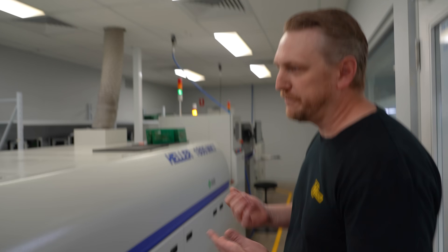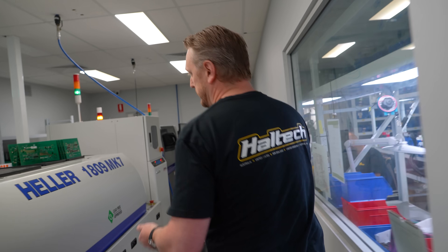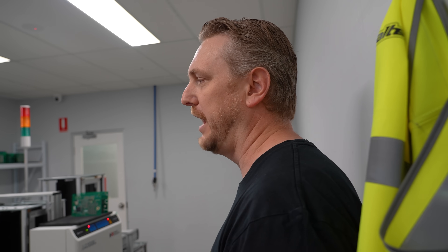We have a different head on the back of this machine just to pick up larger components. All the silicon chips that we place on the board come through to what's known as a reflow oven. It'll transition the solder paste, put it through a temperature profile, get it up to that eutectic point. The solder will go into a liquid phase or molten phase, and then we cool it down on the back side of the oven. So each board that comes off the line now will go through a visual inspection process.